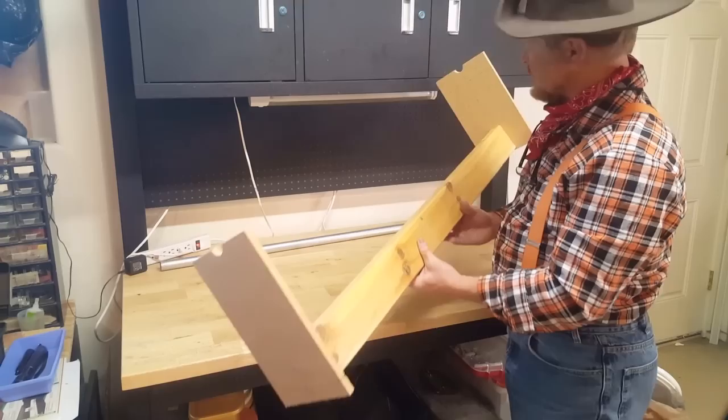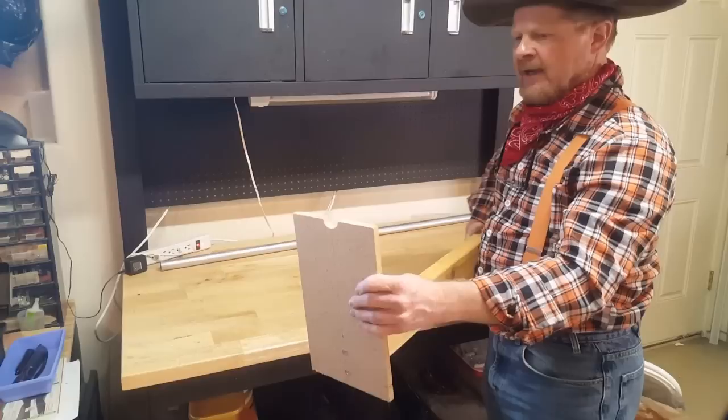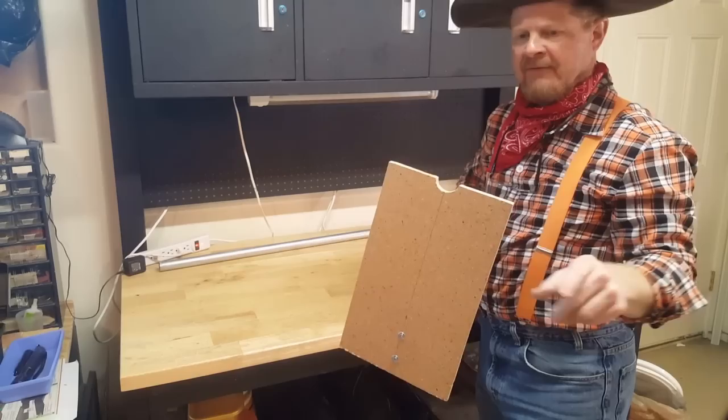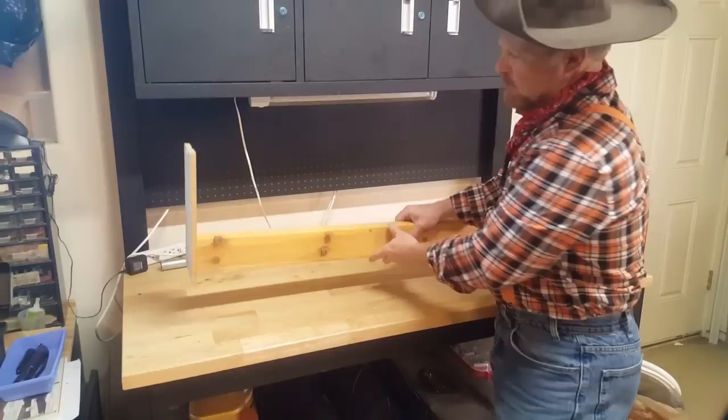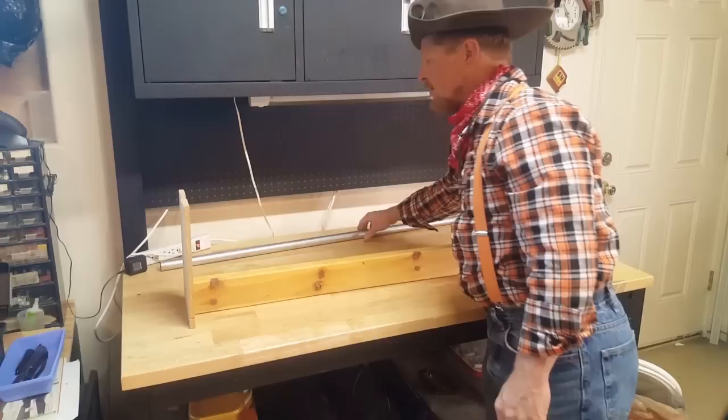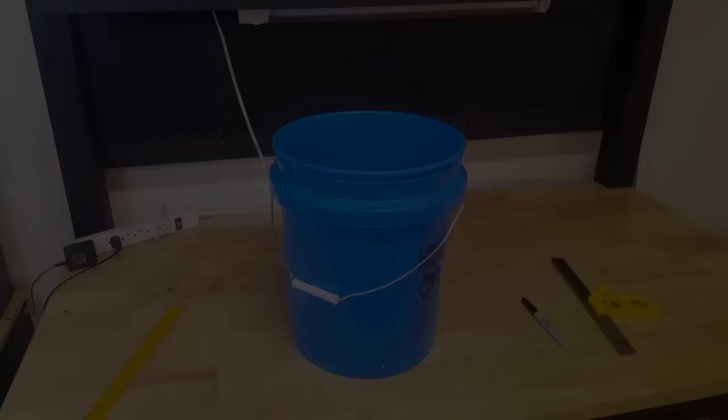The next thing you need to do is build a jig. I made this out of scrap wood — half-inch particle board. It was one big long piece, I drilled a one-and-a-quarter-inch hole and then cut it in half. It measures about 12 inches high, seven inches across, and I have a two-by-four that's about 40 inches, which gives you plenty of room to work with. This cradles the one-inch conduit pipe and lets you sit it down on the counter for stability while you're putting the trommel together.